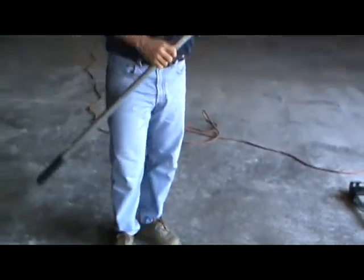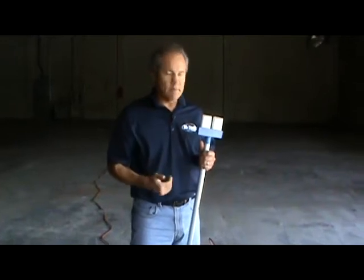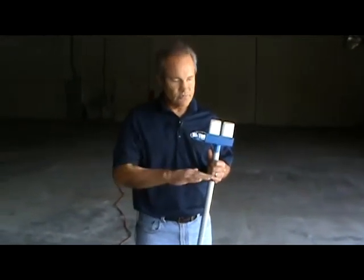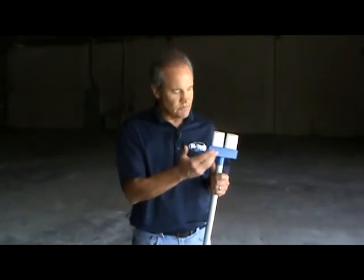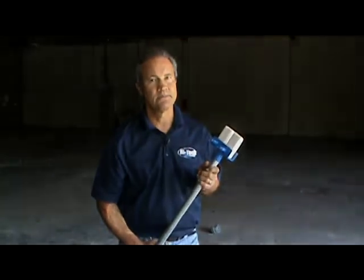It's really good when you're dyeing a floor, polishing a floor. You can put the soap down before you fill with the joint filler because you've opened up the floor with your diamonds, and now the soap keeps the polyurea, or PE85 or 75, from sticking to the opened up floor. So it's a great, simple product. You can give us a call and we can ship one out to you.